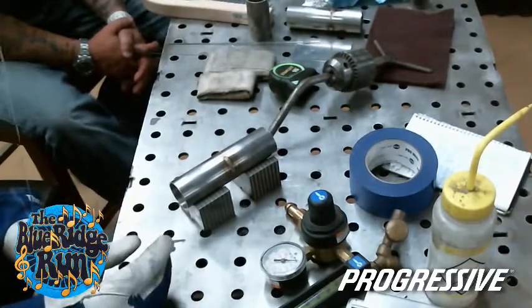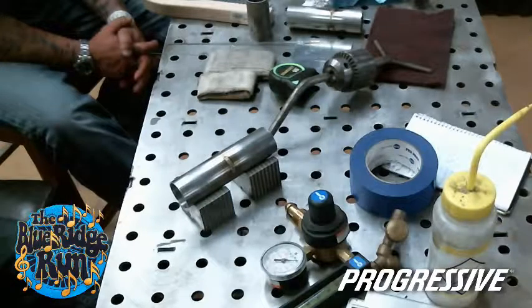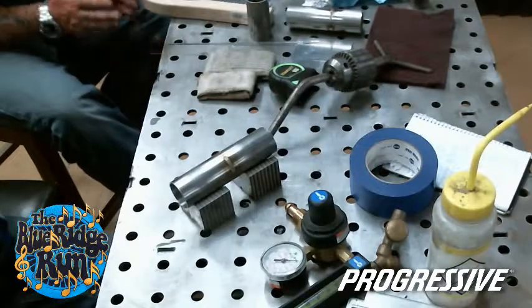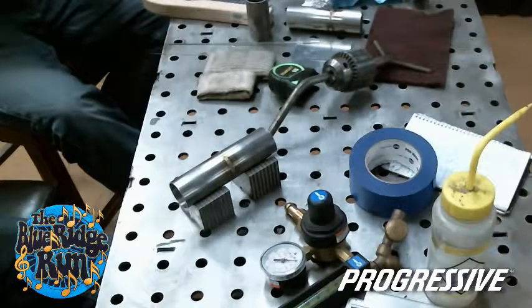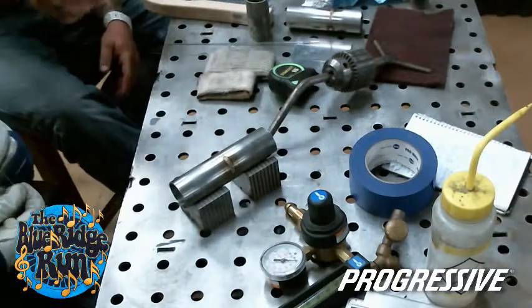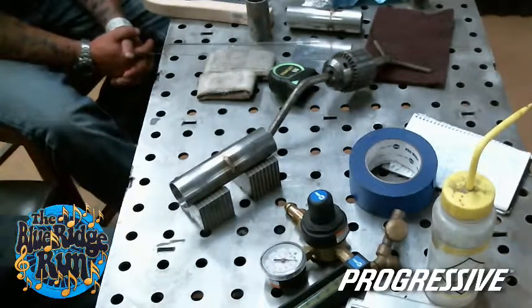So the tighter you're pointing the tungsten, the more direct it is. I've always assumed that the longer the taper, the more direct, pinpoint it is. And as you come out with a bigger degree and have wider tungsten to a quicker, sharper point, that's for larger fillets. So I always kind of go the route of a more long-tapered one. Again, I don't get real precise about it. I just do what you normally do.